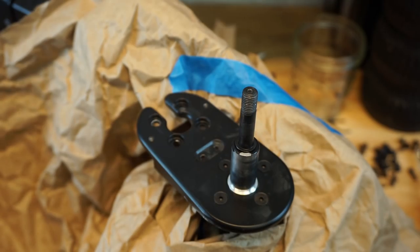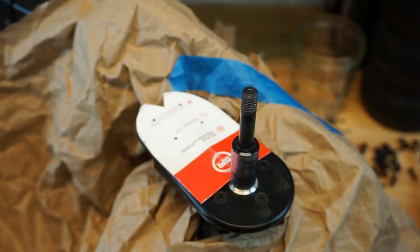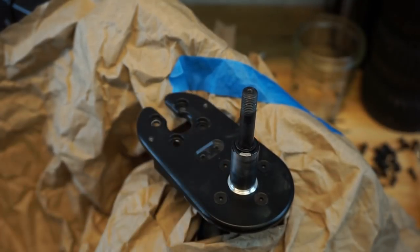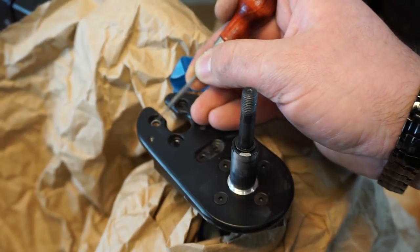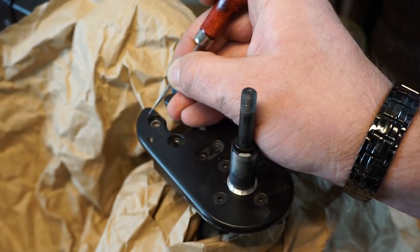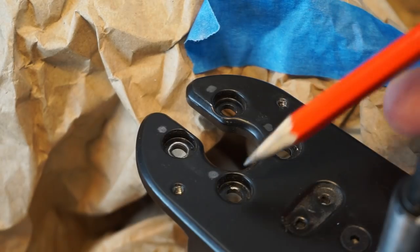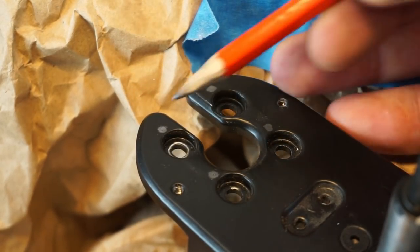You don't want any shavings from drilling to go anywhere near the motor or any other parts. I'm going to protect all the parts even further. You can either make yourself a template like I did, and chase out the original holes where the motor used to be fixed, then push the template forward and mark the new holes. Or you can trust what I'm doing here — in line with the centers of the original holes, we need to drill new holes just a little bit further out. I'm talking about two millimeters, no more.